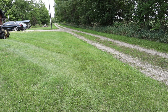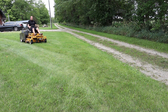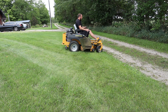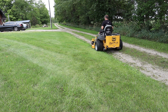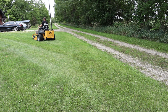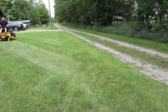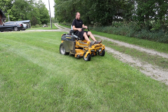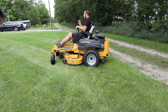So that's two ways of doing it — what I consider a three-point turn, some people call it a K-turn. But there are other ways. You can even go this way: stop like this, go out into the driveway, come back, and then back into your line. There are many ways you can do it. The key thing you want to concentrate on is keeping those wheels moving. As soon as you stop that one drive wheel and pivot on it, that's when you tear up the grass.